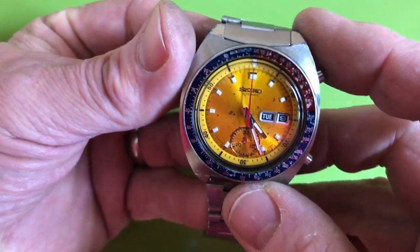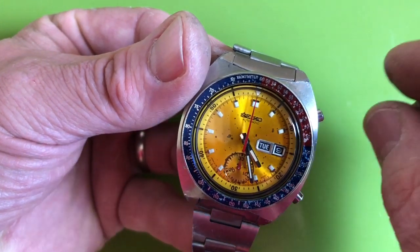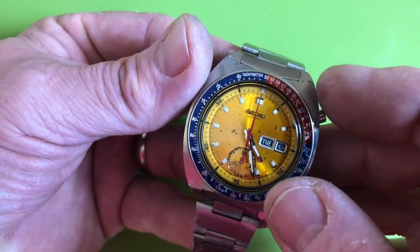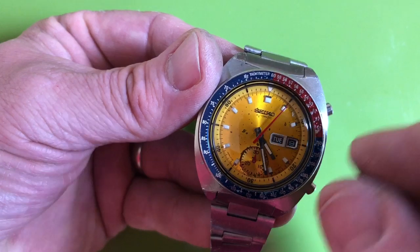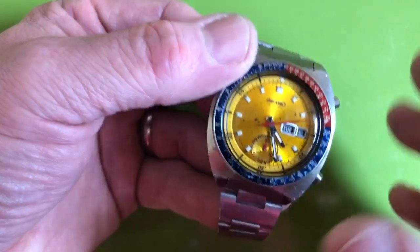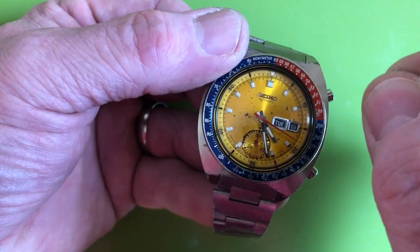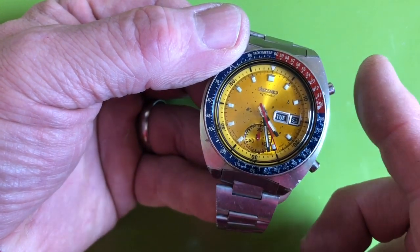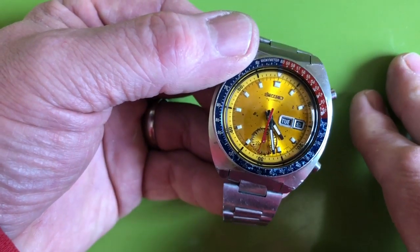Now with this, oh gosh, I forgot about the most important part. The chronograph wheel. I was able to save your chronograph wheel. Granted, it was a little shorter, but what I did is I very carefully, using some jeweler's lathe, I took down the shaft, because the way these things are worked is that pinion that you saw that was broken, they're keyed. The one side of it is flat. And that's so that when you press the hand tube onto it, the tube deforms and holds to the pinion. So what I did, a lot of that flat section had broken away. So what I did is using basically jeweler's tools, I went and I extended that flat section down. I machined off another little section further down, and there was enough room that I was able to sink the hand on, and it is holding.